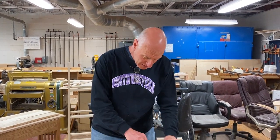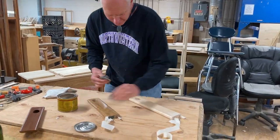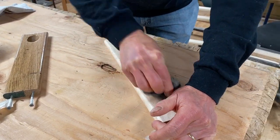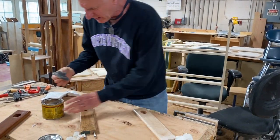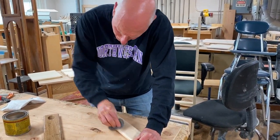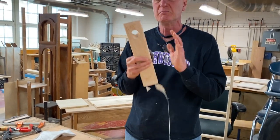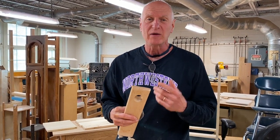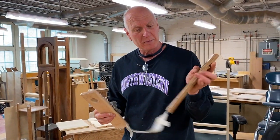If you remember our lessons on polyurethaning: I put a coat of polyurethane on, scuff sand it, take all the dust off, then put another coat on, scuff sand again, and so on until it feels good. When I looked at these, this maple is always super clean if I put at least three coats — sometimes four, which I did on this one. Then waxing it makes the maple come out jet smooth, which is why I really wanted to work with this.